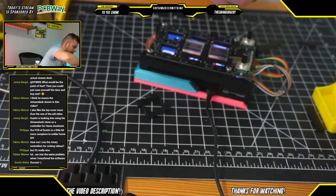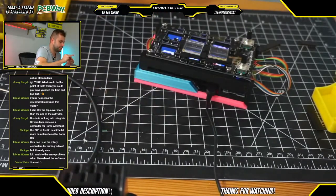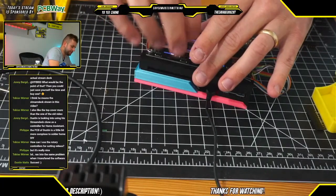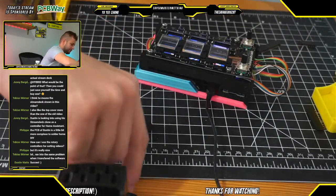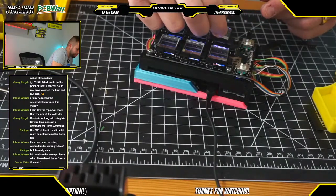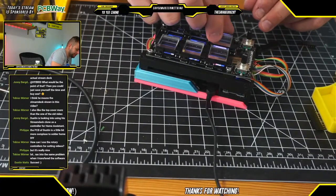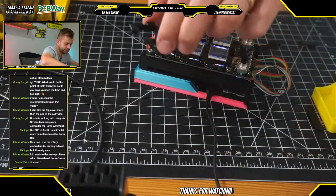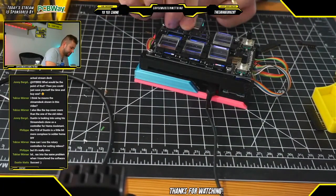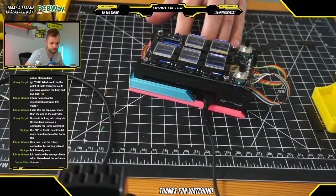Now, one note too is that in order to interconnect mechanically, these will fit a couple different ways, kind of like if you jam a puzzle piece into a puzzle at the wrong location. But there is one correct orientation for these, and you'll feel that it's the correct orientation when you put the button covers on. If you have a multi-material printer, you could maybe color code one or mark it in some way, even with a Sharpie after you print it, so you know what orientation these go into. That's just an optional step that would make the build a little bit easier, but maybe something that I will do in the future for those that have access to a multi-material machine.